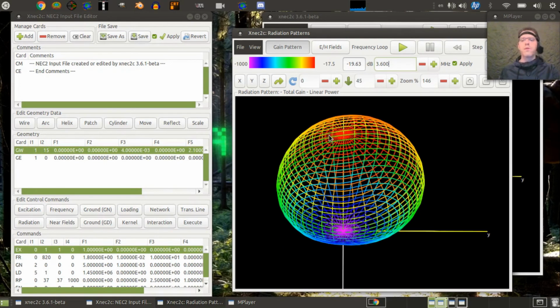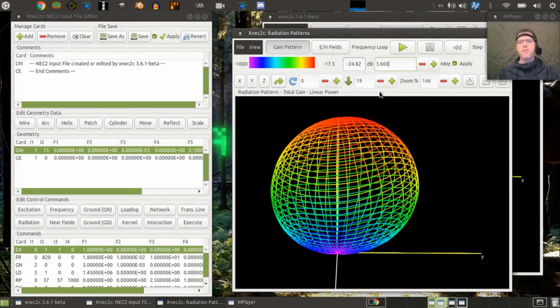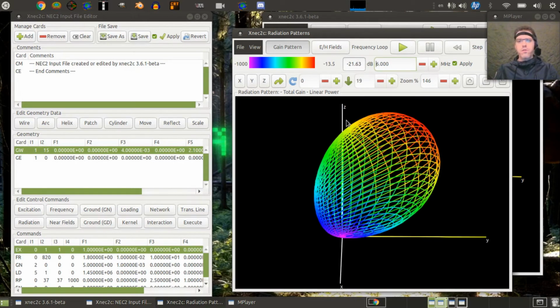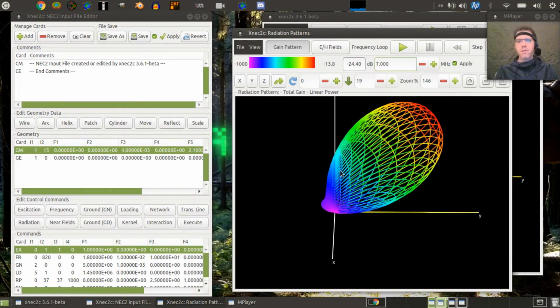So in this case, here we have the 80 meter band, and we have the 21 meter antenna. It would basically simulate having a link in the antenna that you disconnect if you want to use the high frequencies. And here you can see that you have a nice bubble on the 80 meter band with the antenna that lies flat on the ground. So here I have modified one of the 3 variables that would affect the radiation pattern: the length of the antenna, to accommodate the frequency that I want to use. So now this scenario is different. I can probably continue using this up until maybe 7 megahertz here.